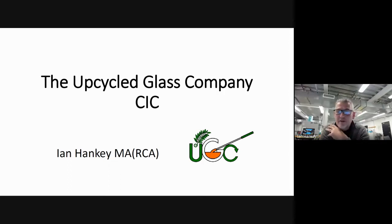Oh, absolutely. Anything, you can contact me. I'm actually looking for an oval, like the old oval kiln, so I can put two pots in there, because I know I can take the pots up in 2 hours. If I have two, I can have a clear glass in one and a coloured glass in the other, and that's where we can really do some wonderful stuff. And if we colour our glass ourselves, we're colouring our base glass. We're not buying loads of different glass rods, which may not be compatible with each other and with our base glass. If we make our own glass and our own colour, whether a coloured pot or coloured rods that we make one day, we know it's all from the same homogeneous melt.